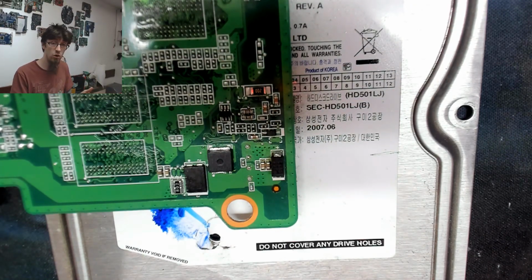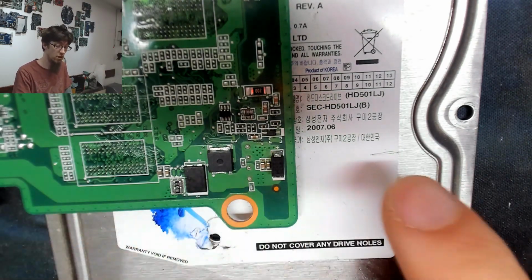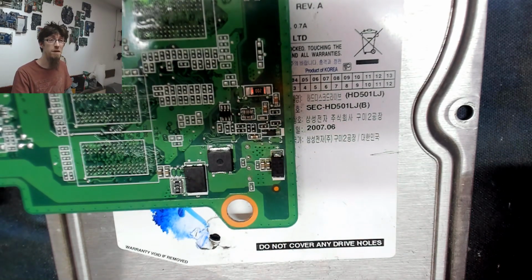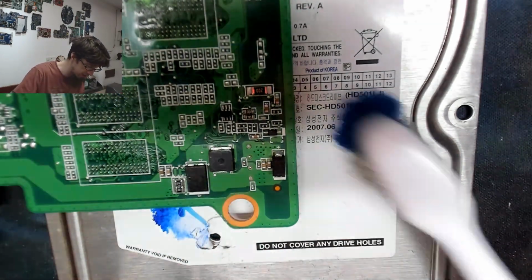So when you plug in the laptop normally, the diode does nothing. However, if you plug in the charger the wrong way round, which obviously you shouldn't be able to do because it's a barrel jack, but if for some reason you plug in an incorrect charger, or the wires cross, or voltage flows in the wrong direction into the laptop, then that diode will begin to conduct that voltage directly across to the other side again. So instead of the voltage going into the laptop, it will go through the diode and straight out again in a dead short. And that means the power supply will cut off, stop, break, blow up, instead of the laptop blowing up. So that's what that reverse voltage diode is there for.